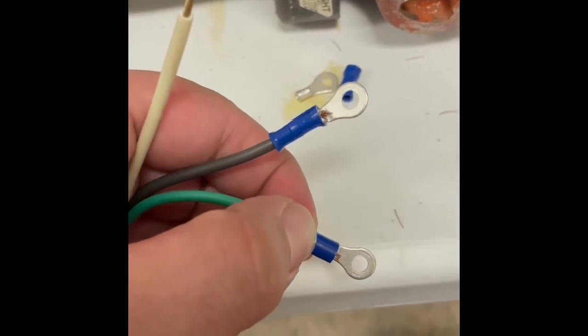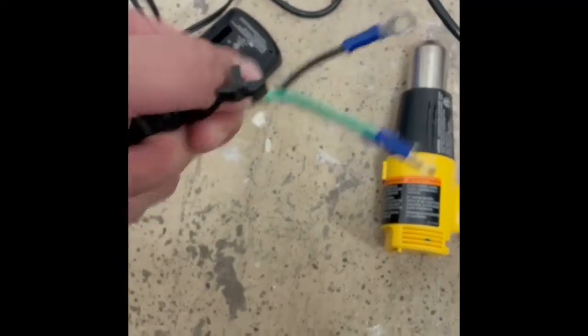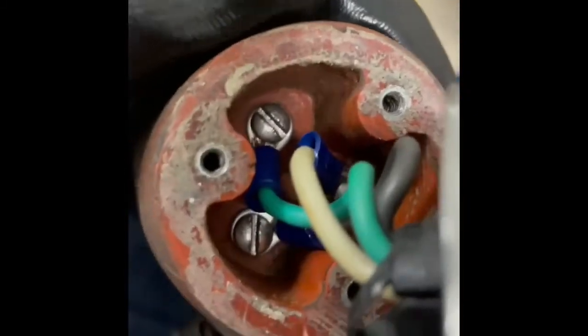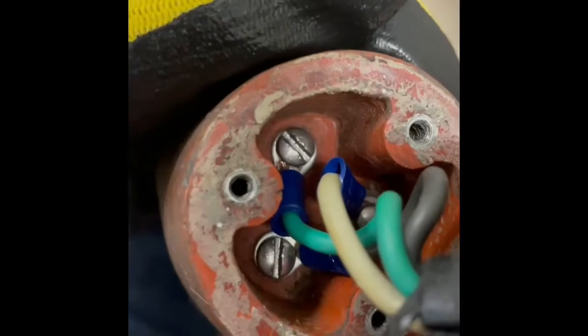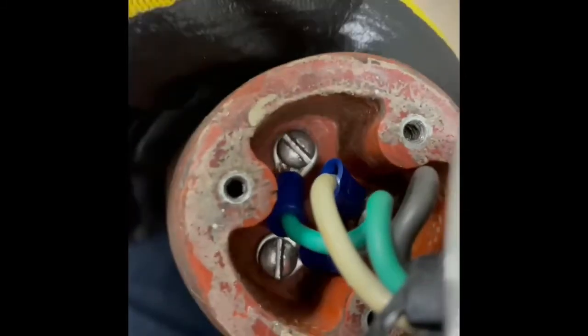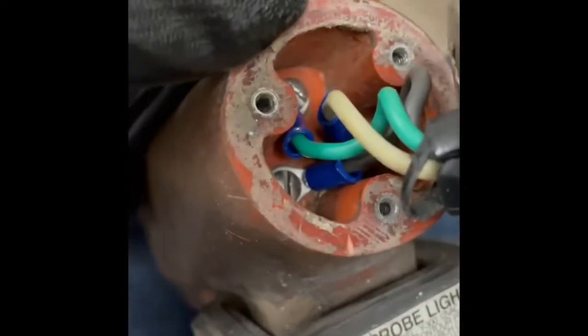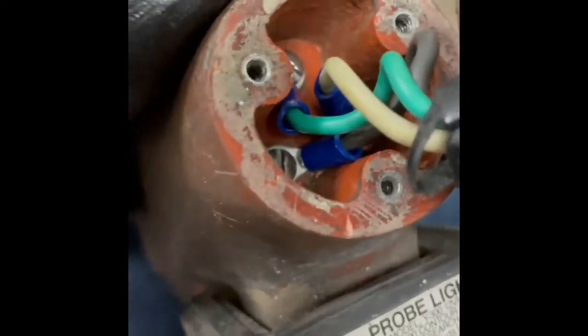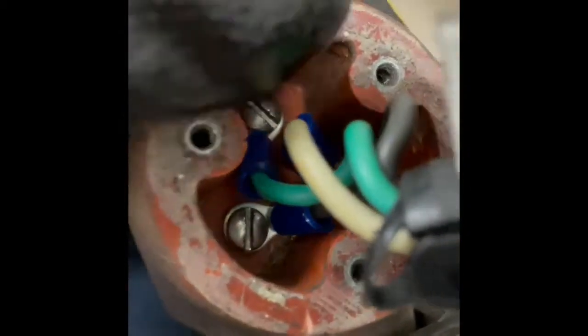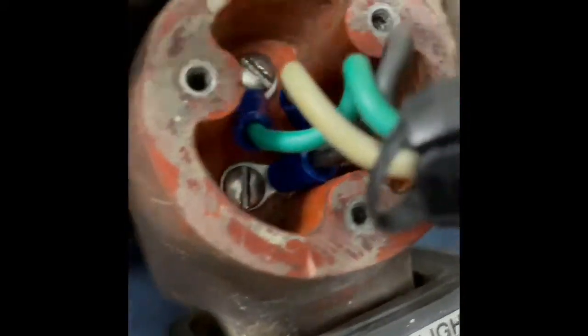I'll get them on and then we'll come back and take a look. After we get those crimped on, we're just going to use the heat gun to further seal that. So we connect it back into our prongs — you don't want to over-tighten these. Do a good hand grip, tighten, and then just come back with an extension screwdriver. Again, you don't want to over-tighten; hand-tight is plenty. Then all we're going to do is place this back in. You can use various different types of sealant, but the only thing I have available is a hot glue gun, so I'm just going to put some hot glue around it. This is just to keep this from getting dirty inside anyway. There's a whole other housing for all the other components inside, so it shouldn't be that big of an issue.